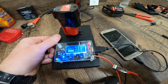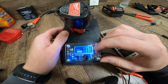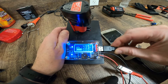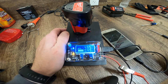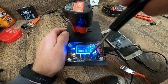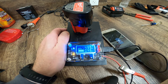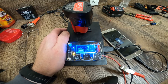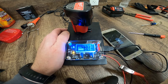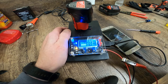I do believe this has a USB setting — you have to turn it to USB before it's going to output your USB. So I unplug that, select USB, hit enter, and there I get my USB light. We can see our amperage output there. My phone screen came on, it's recognizing a charge. I'm going to see if we can increase the amp output, and we can't. That tells me the phone is probably metering that it's only taking about half an amp charge. So 4.95 volts, about half an amp charging, and we can see that my phone is charging.